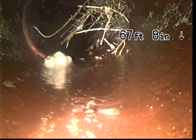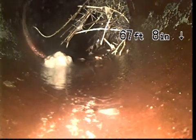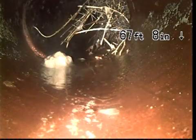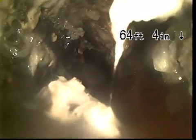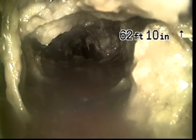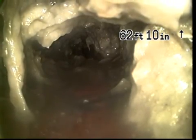But running the camera through there and having the cleanouts there, it's something that can be maintained in the interim by just running a snake. So it's usable. Snake versus jetting. Actually, jetting would probably be a little better on this than the clay. So there's two spots that are in partial blockage. Yeah, see the paper hanging down when he brings it back through.